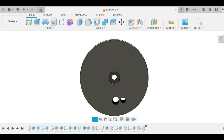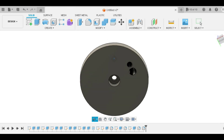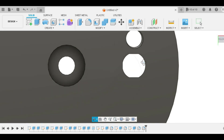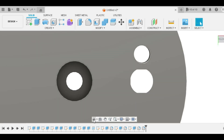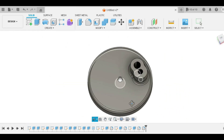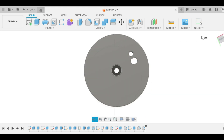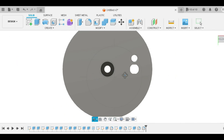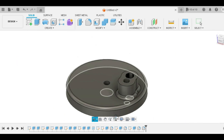This is the model I've come up with for the snout trimming tool — it's pretty basic really. The only things we needed to know: the shaft size is three-quarter inch, and I drew the profile of the boring bar. This here is just an M10 by 1.5 thread to mount our threaded rod to apply spring pressure. The only important part was to get the dimensions from the tip of the cutter to the shaft. We want to bring it down to 55 millimeters, so that was just offset from the center that far and it's ready to go.